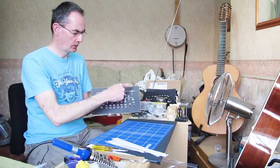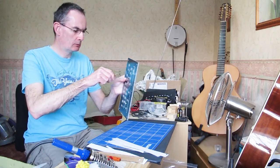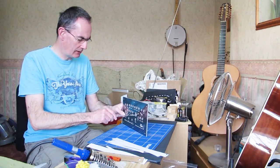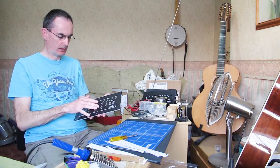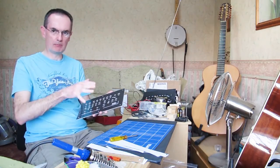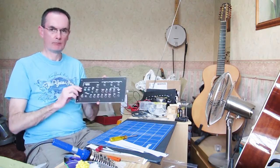The graphics are parallel with the edge of the board. Put the nuts back on — hold the nut with a finger and go a little past finger tight with a screwdriver. Don't tighten too tightly — at worst you can crack the acrylic, but before that you'll start to see the surface warp with dimples around the screws. The panel is now ready for the components.